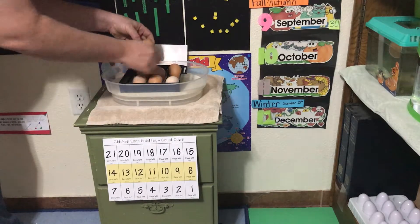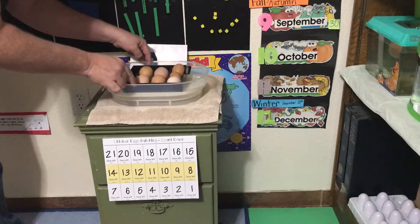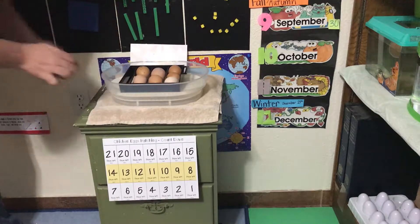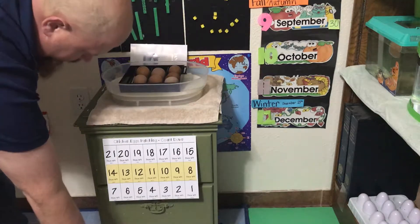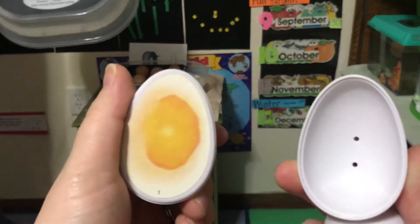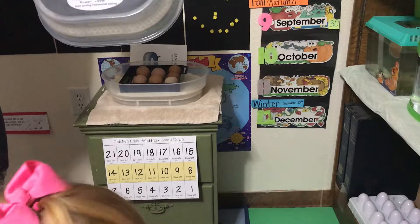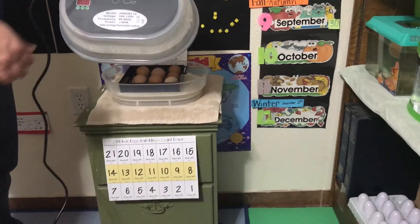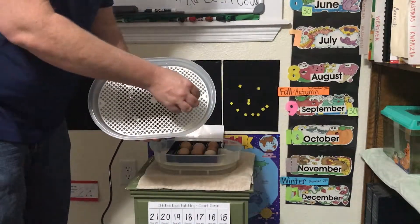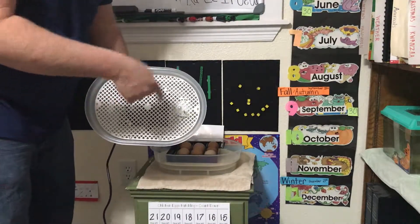John's just arranging them and changing the dividers. You don't want the eggs to be able to move around too much — if they can, they could crack while being moved since the tray just rolls from side to side. On day one the egg is just a yolk. This is the top of the incubator that has the heater and the rest of the electronics in it. This is the egg turner here, and this pin simply goes into that tray. As it rotates, it moves the tray back and forth.